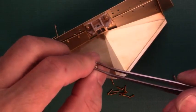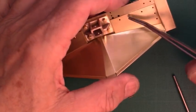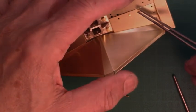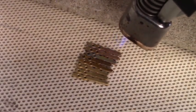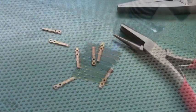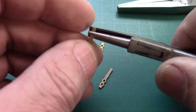The heads of the M1 screws have a key dimension of 1.5 mm. A suitable socket wrench and tweezers are a basic requirement for this work. The brackets of the coupling linkage are heated to red heat to make them soft and flexible. They are bent at the end to an eyelet about 1.3 mm in diameter.